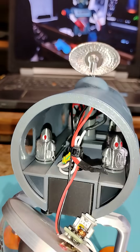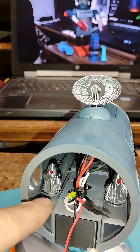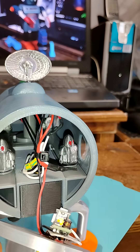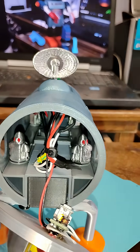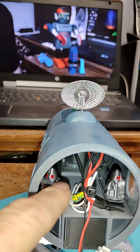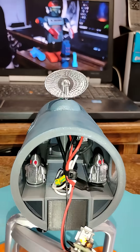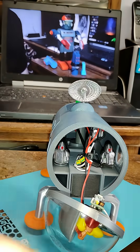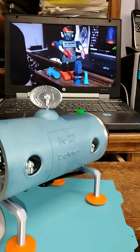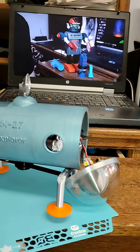Each robot is sitting on a little pulley thing, and there's a Kevlar string. You can actually see the loops, the front ones to the back ones, and then it's secured to this plate. You can see that plate, the string secured to that, and that's an offset cam. So as that antenna shaft rotates, it's going to move that plate forward and backward, which is going to pull the strings forward and backward, which is going to make the little robots turn from looking out the window to looking forward.